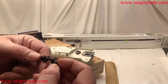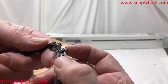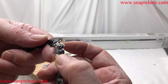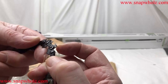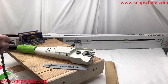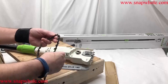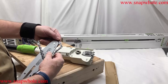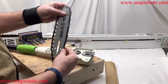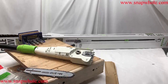The simple way to figure out how the chain goes on: look at these links right here — these are the cutting links. The cut is in this space on the front end of the back of that link, and that link goes forward and cuts. You always want to face that forward. Put it like this so that as it rotates, that's what goes out and cuts. Spread the tip, put a couple of those links down in, then you can go from there.